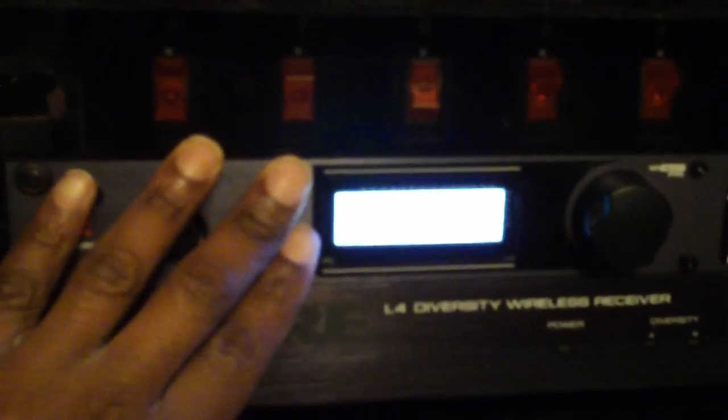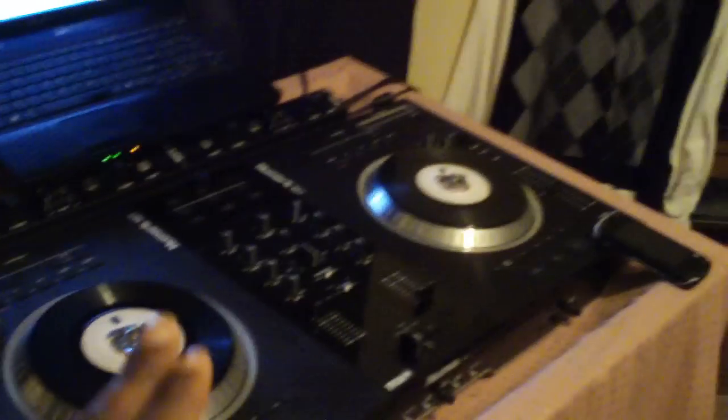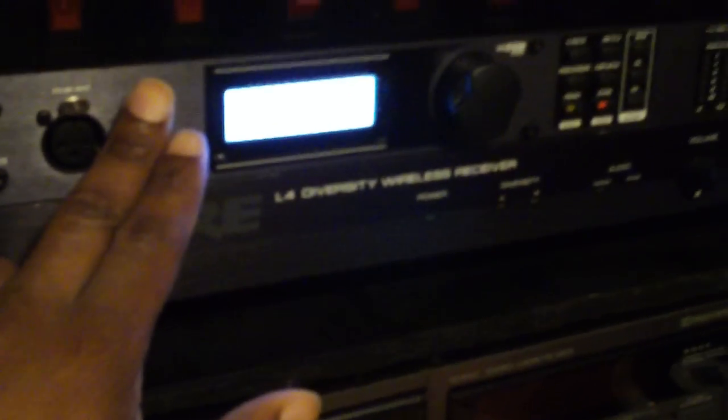Anyway, that's how you use your slope for any given speaker you select, so you can select the right frequency. Just play around with it, get the feel of it. Don't cheat yourself by turning all your speakers up just because you have the limiter activated — it can only do what it can. If you try to turn it all the way up thinking it's going to save it, you're going to blow it. Stay away from the red lights on these speakers — you can have them flash, but let the limiter on this unit take over so any EQ you apply won't hurt it. Some power speakers have EQs built into them like the JBLs — I keep them flat at 12 o'clock on both of these.